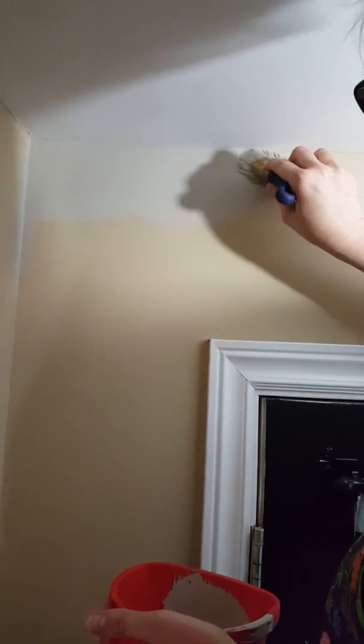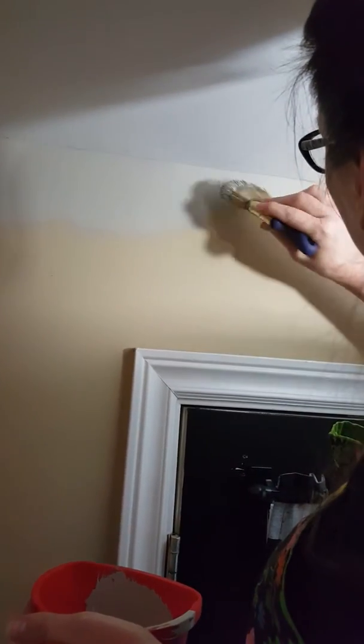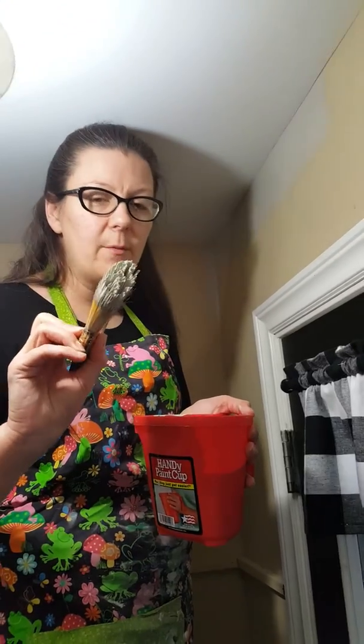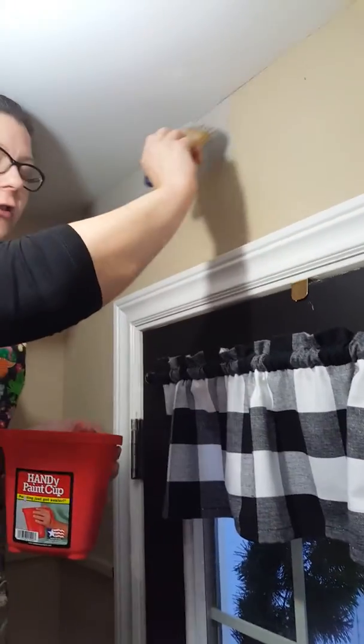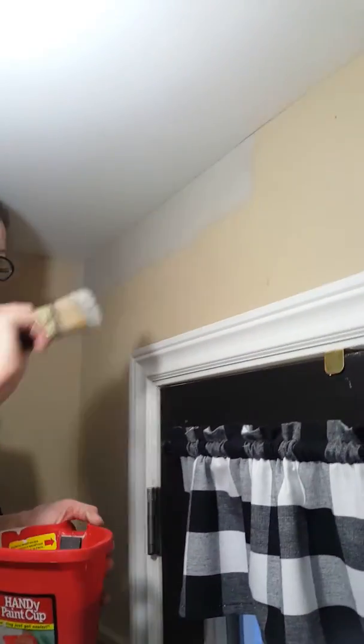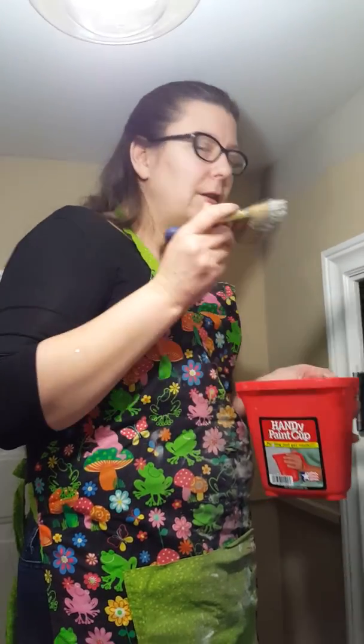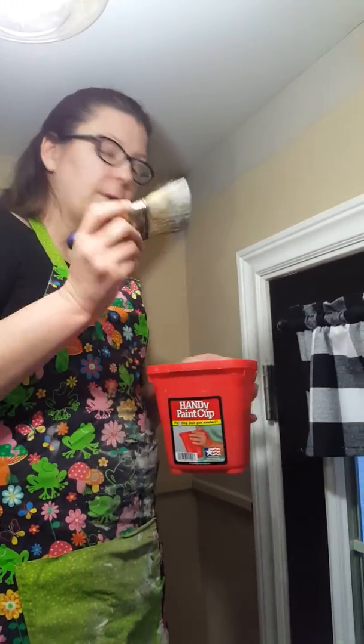I just start pushing up to the edge and come along. The previous mess on the ceiling was from the previous painter, not me — just had to say that. Just run it along, no tape needed. What I like about this brush is that it gets loaded well. I've tried other brushes with wooden handles that look the same, but they just don't hold the paint like this one does. Your first coat would be just as streaky otherwise. This gives you nice, good coverage. I trim all the way top and bottom, trim out everything, and then do my rolling afterwards. I'll jump back on to give you a quick demo on how I roll.